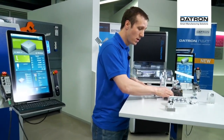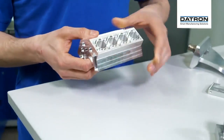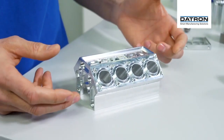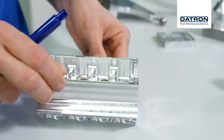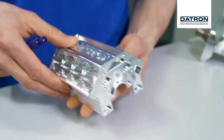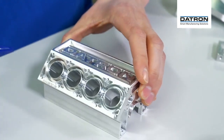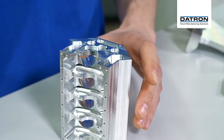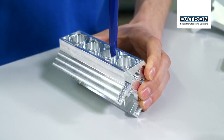If we go over to this table, I've prepared a few sample parts. This motor block — this engine block scale model — is actually a perfect example of an indexing part with a few simultaneous movements. We have two setups: setup one covered all of the inside and the outside surfaces, then we flip it over, just like we had it in the machine, and we can orient the part at each and every angle — including the side pockets, holes, and threads. That's a great sample for 5-axis movement: indexing into a position and then making a 3-axis movement.